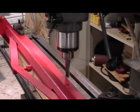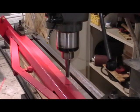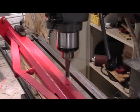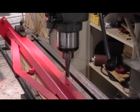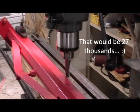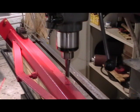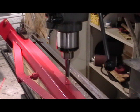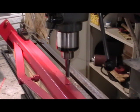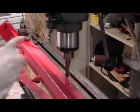We've got the mill set up and we're making our first pass down the leading edge of the shoe. We're only taking off 27 thousandths on this first pass — Jim wants to get everything cleaned up before getting more aggressive with it. We're probably going to make multiple passes. There it is moving down the line — we're milling this piece off.